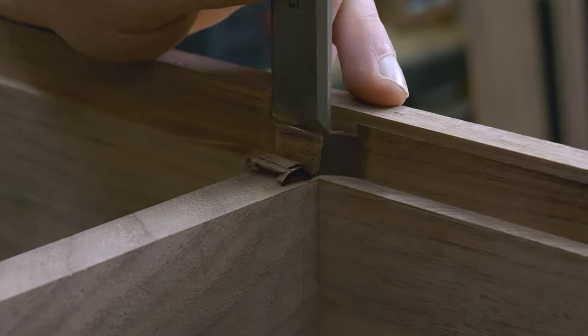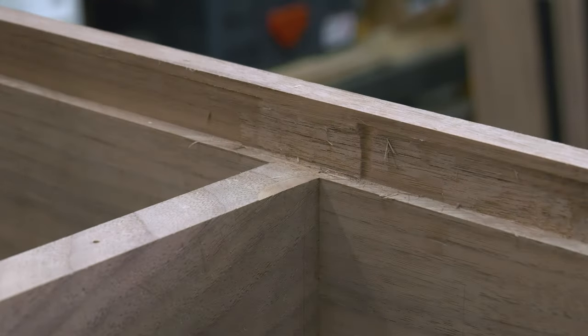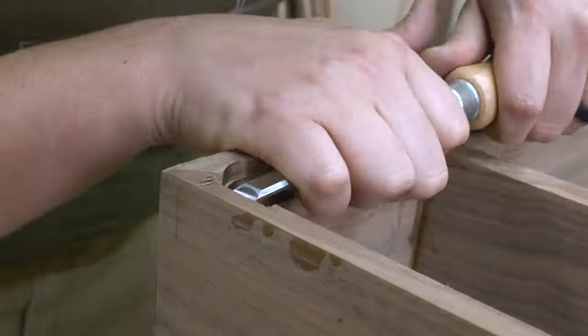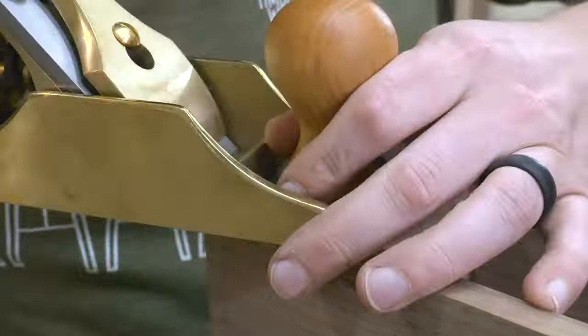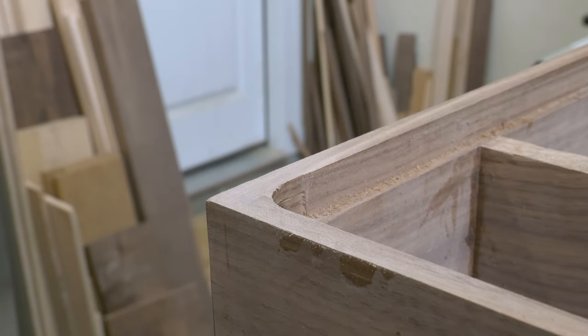Back at the front I had to clean up the notches as well as fix the mistake I made earlier. I started with the notches and a chisel and worked my way to a router plane. To fix the mistake I chiseled out two rectangular pieces, then filled them in with some wood glue and reshaped the corner. You'd never know it's there unless of course you post it on YouTube.